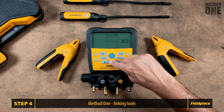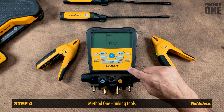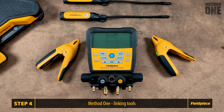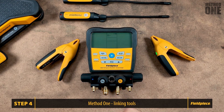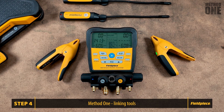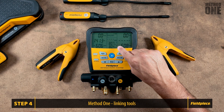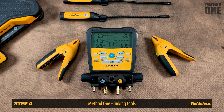To link more tools, press the Link Tool button again and select Yes to search. The S-Man will search and find the suction line temperature pipe clamp ID7041. Press Select to link your tool. Press the Link Tool button again and select Yes to search. The S-Man will search and find the liquid line temperature ID7042. Press Select to link your tool. At this point, you should have both your suction line and liquid line temperatures linked, as well as your return and supply air.